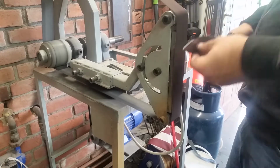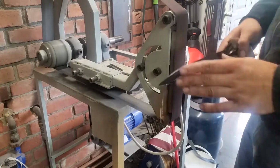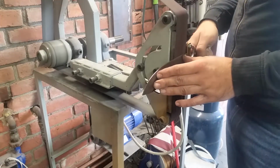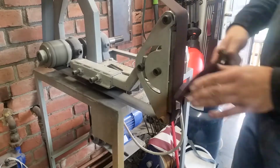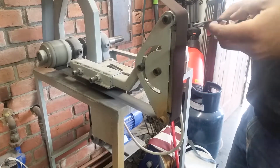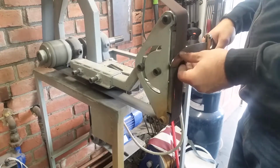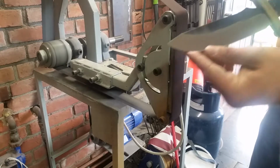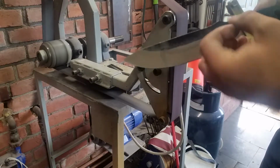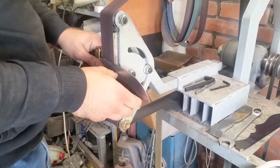And back to talking about grinding. The 40 grit is the coarsest grit I'm working with. Some people work with 36 grit, and I'm scared to do that. I will be frank with you. Because the coarser the grit you have, the more material the belt is taking all at once. So it's faster and it's harder to control. And you can see right here that I have these bumps. So it's not perfect, and I'm pretty pissed about that.